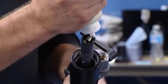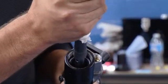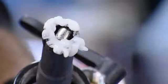And then we're going to lubricate our cutter as well with the tapping compound that comes in the kit. The tapping compound just preserves the life of the cutter. We want to try to keep the heat down on the carbide cutter the best that we can, and we do that by using the compound. This is food grade compound.